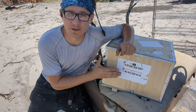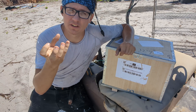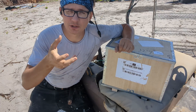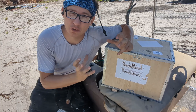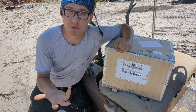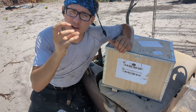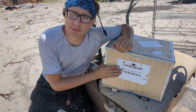I just bought this hydraulic crimper for $900 and what it does is it crimps the fittings — the ends of the hydraulic hoses onto the hydraulic hose. It's a very tough thing; you can't just use a regular crimper because these things need like 10 to 20 tons of pressure to fully crimp down and squeeze, because hydraulic hoses hold up to 3,000 or even 10,000 PSI. So let's get this open and see how it is.